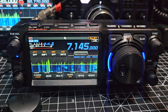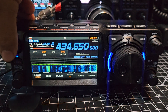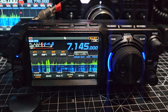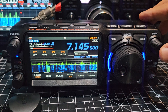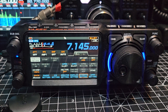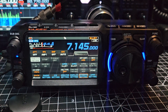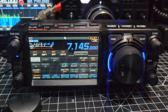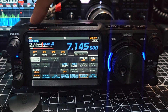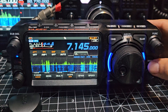So the basics are: you've got separate AF and RF squelch on both sides, you can switch back and forth, you can do single screen. Press and hold the function to get the menu as you saw. Yes, it does APRS — it works. There's firmware already for the USB out on the side. You can charge the battery separately. You've also got a DC input, which I'm using right now. It's 10 watts with DC input. We've got GPS, group mode, and PMG mode, which does work well but you need to put in some memories.